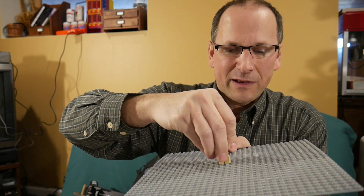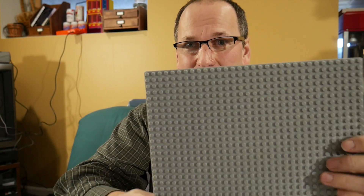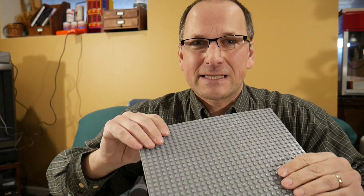The base is only 1.6 millimeters, and then another 1.6 millimeters for the knob. You can get good models for these on Thingiverse. They have to be precise enough so that minifigs and other Lego blocks will connect to them but still fit on without just falling off. This thing weighs 150 grams. Here's one that's not quite so good — it comes apart easier. So now I know that across 10 inches this thing is precise, because bigger Lego pieces have to line up too. Even if it's not perfect, it's a useful Lego piece. Instead of useless calibration blocks, I wind up with reasonably good Lego pieces — and even custom Lego pieces.